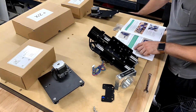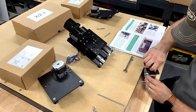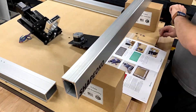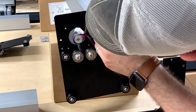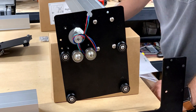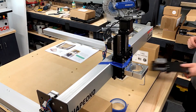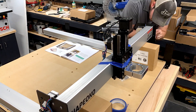I'm working on the Z-axis now. The only thing I messed up — which I found out about a week later — was on that metal mount. There's a round coupling that goes in from the top to the bottom on that little silver router mount, and I actually put it in upside down. So read your instructions. Also, when you put the axis side panels on, those wires wrapped around the two wheel pulleys — make sure you undo those before you mount the actual rail. Found that out the hard way.